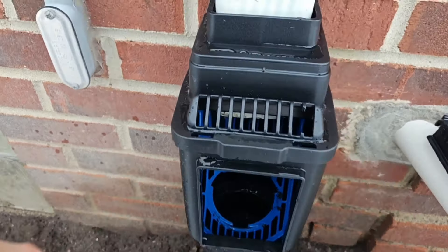You want to take this heat tape, unbox it, lay it on the ground, plug it in, and make sure it works. A lot of these cheap heat tapes do not work — believe it or not, brand new in a box, they don't work. You don't want to go through all this work of installation only to find that. Also, you want something that's a watertight connection for your extension cord — this basically goes over the end of the connection point between the extension cord and the electric plug for the heat tape.